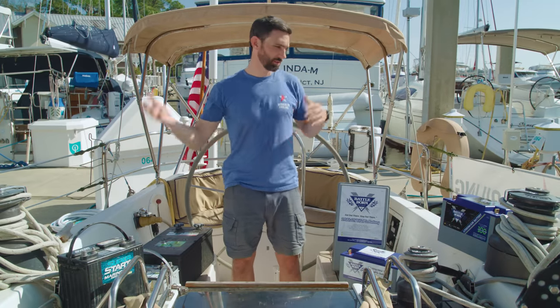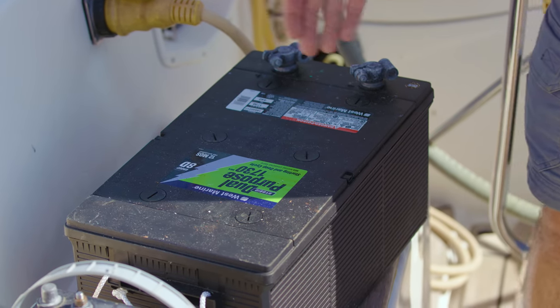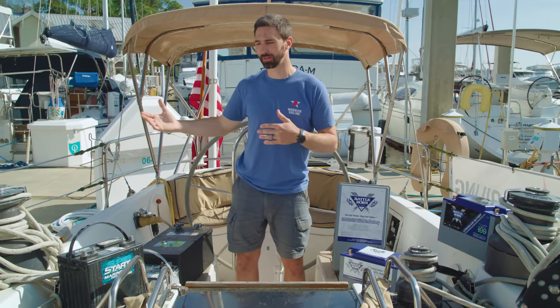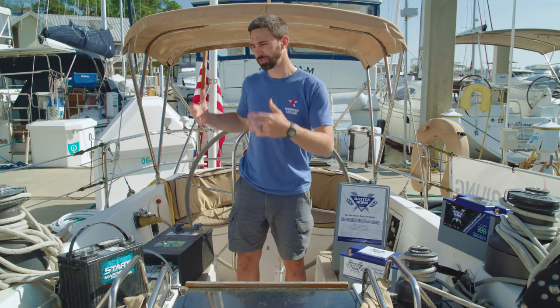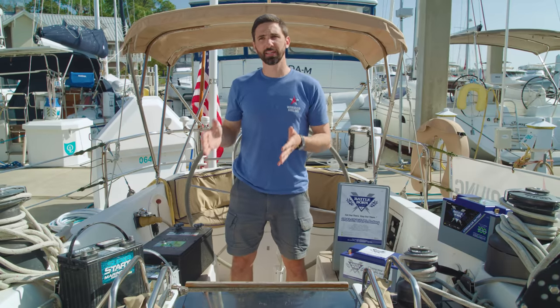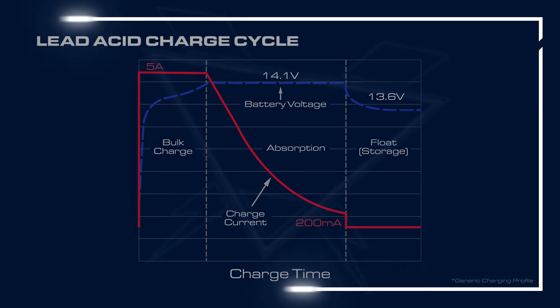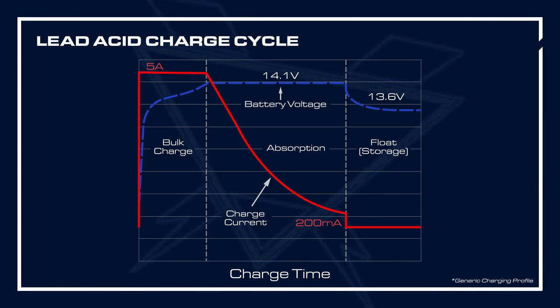What are some of the benefits and considerations when upgrading from lead acid batteries to Lithium Iron Phosphate on your sailboat? Lead acid batteries like to be fully recharged after each discharge, and that's really challenging on a cruising boat. Often we are off the dock, away from shore power, and it's hard to fully recharge them, which is the cause of death for so many lead acid batteries. Whereas Lithium Iron Phosphate operates really happily in a partial state of charge. The other issue with lead acid batteries is the recharge time. The current that a lead acid battery can accept decreases as it finishes its charge, so the last 10 or 20% of the recharge takes longer and longer to complete.